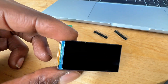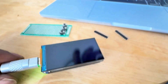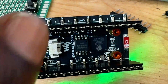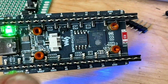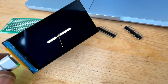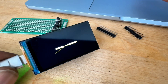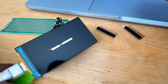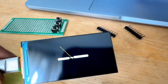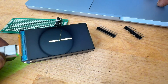Here is the device. I'm going to plug it in so you can see the really cool display. Not only is it a development board, it also has an area for a battery, a screen attached to it, and an RGB light as well. It's a pretty nice 1.9 inch screen — 170 by 320 pixels, 262,000 colors, dual core ESP32, ST7789 display driver, 2.4 gigahertz Wi-Fi, and Bluetooth BLE 5.